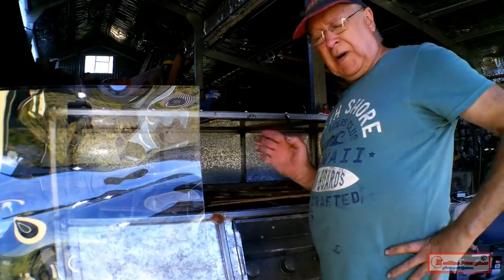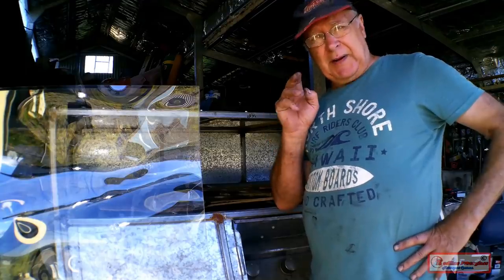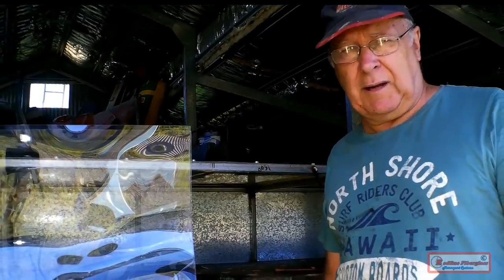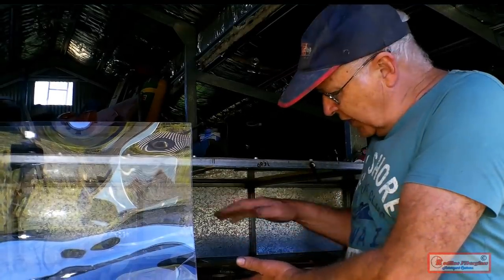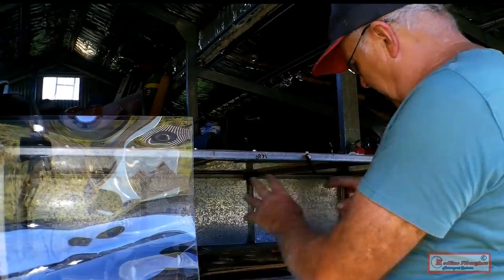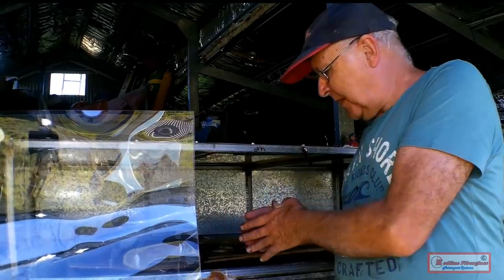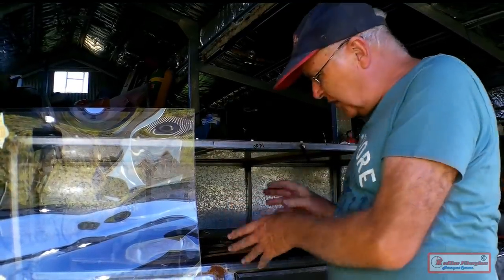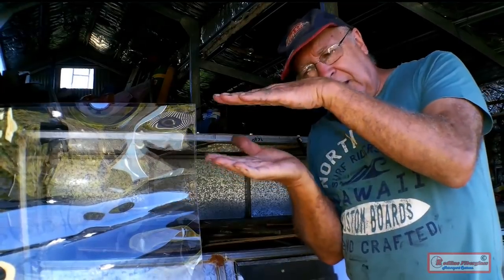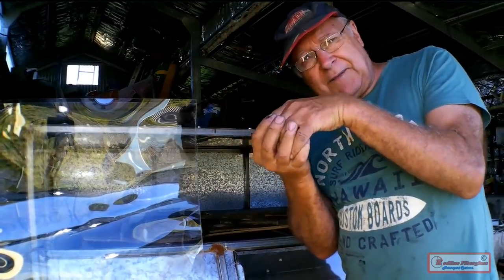The difficulty with pre-drying Lexan or acrylic clear sheeting is that the temperature at which you have to pre-dry is just below the melt temperature. One temptation when you're moulding Lexan or acrylic clear sheeting at home is to put several sheets in the oven with doweling between them when you're pre-drying to save off gas. But the problem with a homemade barbecue like this is that it's not to the standard of an industrial oven. And so you can have problems. If you get the slightest heat spot within the oven, your sheets, even though they're separated by doweling, will come together and touch, and then they'll glue themselves together and you'll lose both sheets.